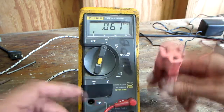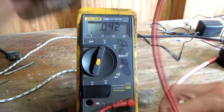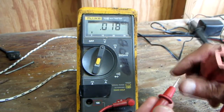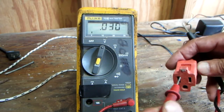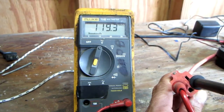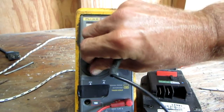I'm going to volts AC and plug my meter leads into the end of this extension cord plug. When using your meter leads, as long as the metal part is touching anything metal, it is going to be hot, so make sure you don't touch the metal on that lead. This ridge built up on the lead — don't put your hand any further forward of that ridge. That ridge stops your hand from sliding into a hot circuit and shocking yourself. We're reading 119 volts, which is good. You'll always read a little lower because there's built-in resistance on your contact points and your meter lead wiring has resistance.